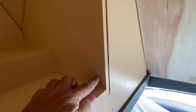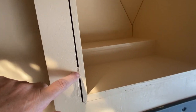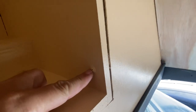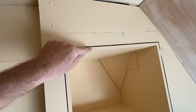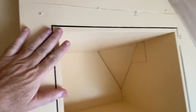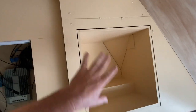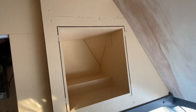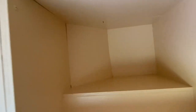A key factor in all of this is that it's removable. The other steel framing is right on this side as well as right over here, so I just put a couple shims in there — basically just four self-tapping screws in the corners. When I attach the final trim detail that'll go around, I'll pin nail it to just this part of the cabinet itself, so it won't be attached to the wall. That way if for any reason we need to get to the wiring, you just pull these four screws and pull the entire unit right out of there.